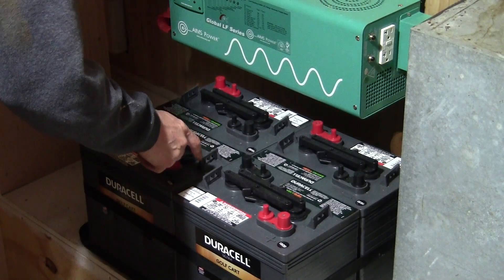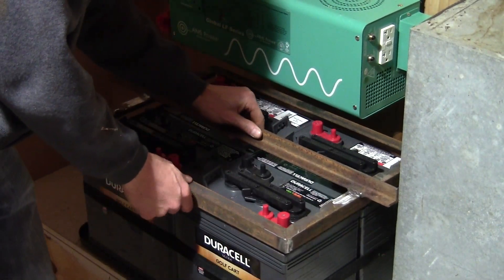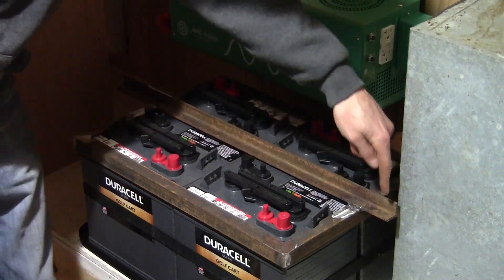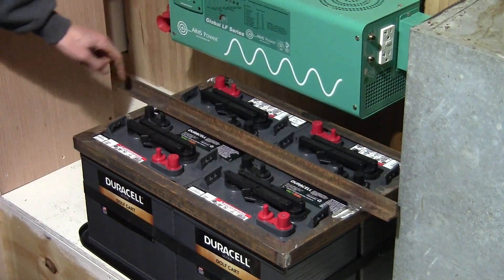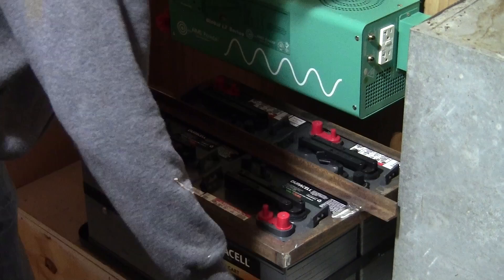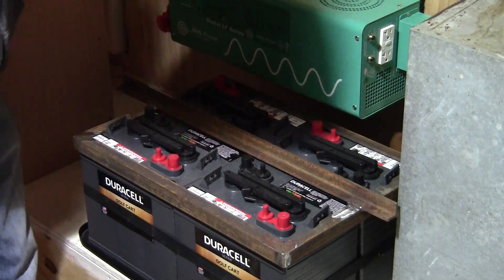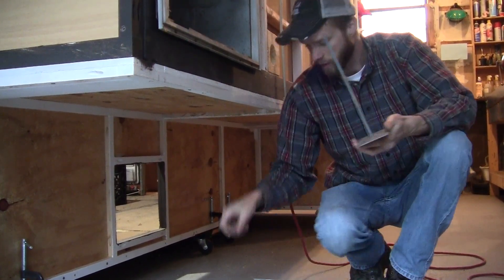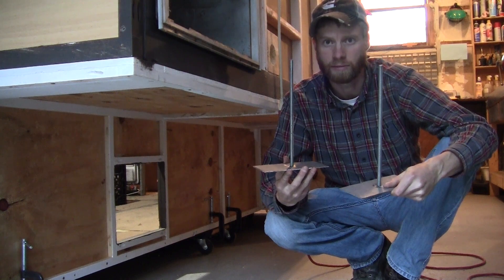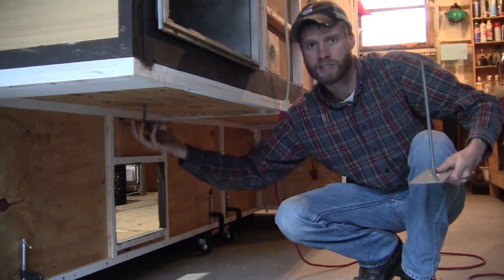Got the batteries — here's the hold-down, just finished cutting notches for clearance. Holes are going to get drilled here and here. I'm going to cut this down to length and threaded rod is going to come up and tie it down. Because it's angle iron, it'll both contain the batteries together as a group of four and also hold them down at the same time. Two plates with threaded rod and welded nuts on the backside — these are acting like big washers.